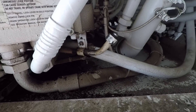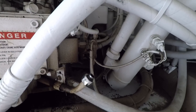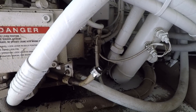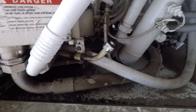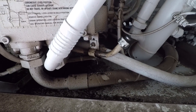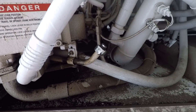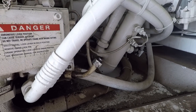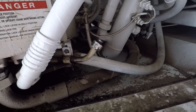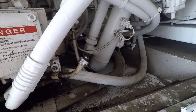When it leaks on this crane you lose your air pressure and then the DEF system doesn't work properly. And when the DEF system doesn't work properly, the crane goes into limp mode. Last year we actually had to fly a guy in from Houston to hook his computer up to this thing, called Germany — called Mercedes in Germany — to get a code to get it out of limp mode, because the previous air hose had started leaking. So we replaced it with this one, and now it has started leaking.